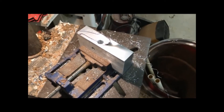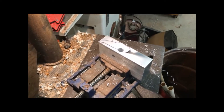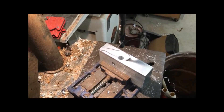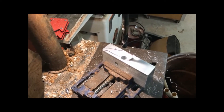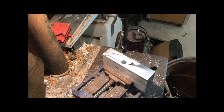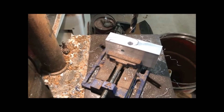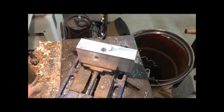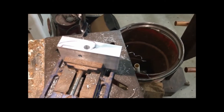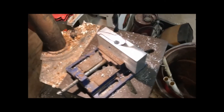I've been step drilling, coming up in sizes. I happen to have a little larger bit set. It looks like this side hole is going to be closer to 5/8ths while the top hole is going to be closer to 9/16ths. I'm kind of gauging it as I go against the original. Aluminum cuts a little easier than I thought steel would, but I have a bad habit of trying to hog it out like I would a piece of wood, so I'm having to learn new techniques as we go.